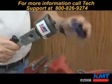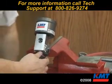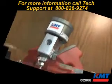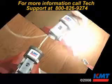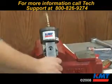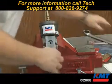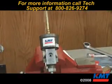First, place it in a vise and remove the blue cover. We need to apply air pressure to the actuator to take the tension off the needle and seat inside. It takes about 75 to 85 pounds of air pressure to operate the valve. Take an inch-and-a-quarter open-end wrench and break the nut loose to take the tension off the stem and seat. Then remove the air pressure.